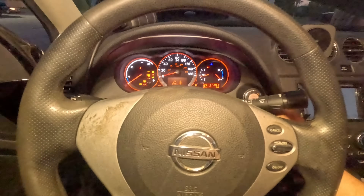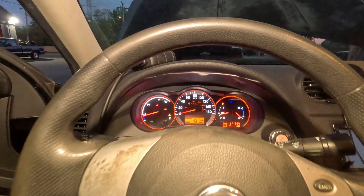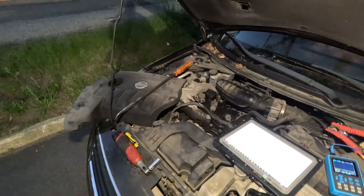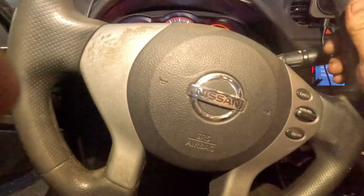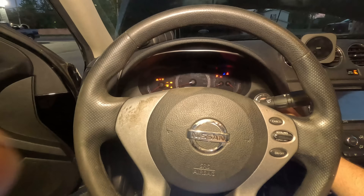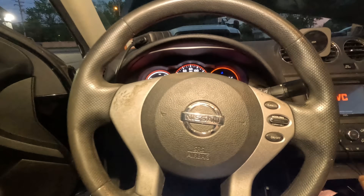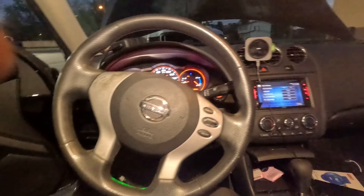Now let's try to start it. Put on the brake - it's running! It says READY. It's misfiring because a coil is missing, but that's just a rabbit hole. The codes had to be cleared one module at a time - that was the whole problem. The car is fixed. I need to get a new coil, do a rescan, but the car's running. Put it in drive - yeah, it needs a coil, it's misfiring too badly. Thanks for watching!